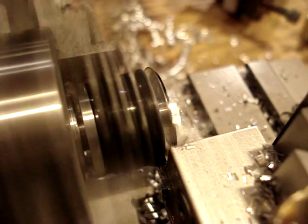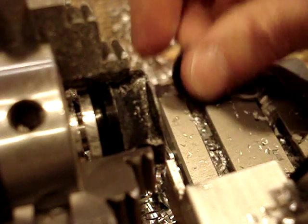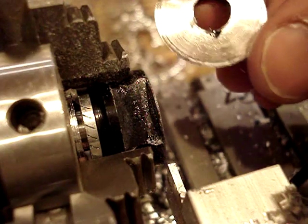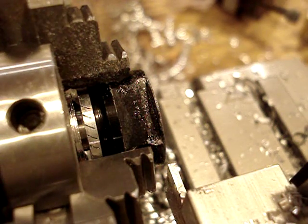I'm not even pushing it — just going slow. That was a little rough because I was doing it one-handed, but that's cutting in about half an inch, maybe even five-eighths — hard to say, I don't have my calipers there. That's kind of how it should feel. You should be able to pull that nice chip off, as you can see there.